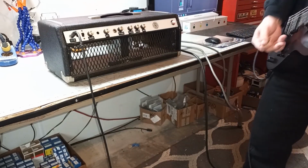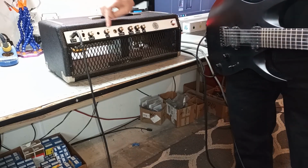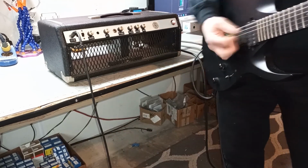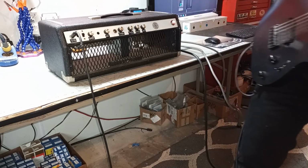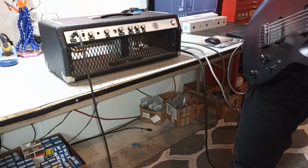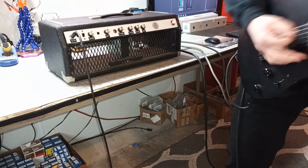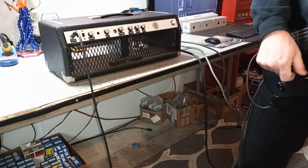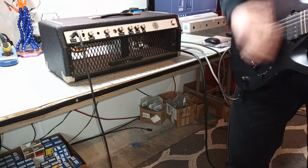So, I mean, here in the room, you can really hear the low end kind of woo, woo, woo, woo, because we're pushing a couple things hard into the phase inverter. So now you can really hear that thin out that happens on a classic Marshall master volume on a JCM 800, which was the big complaint from Plexis to Marshalls, was that that master volume thinned out the tones so much.